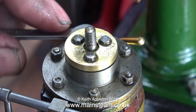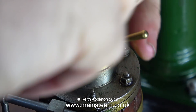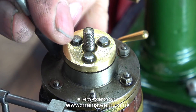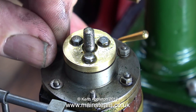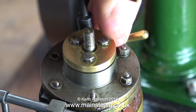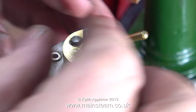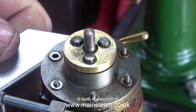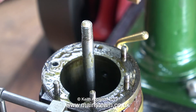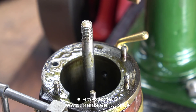So what's the plan? Well, in my book there's only one plan: make a new piston and piston rod and throw the other one in the bin. In this clip I'm removing the nuts from around the cylinder cover. I'll loosen them with a small spanner, and here I'm removing them using this very small and very useful small socket. In no time at all the nuts are all removed. To break the seal, as usual I'm using a Stanley knife blade, after which the cylinder cover comes away quite cleanly. I'm going to discard this gasket because, as you can see, it's rubbish — I'll make a new one.